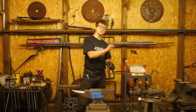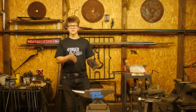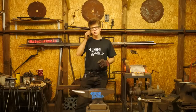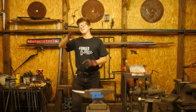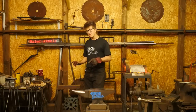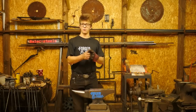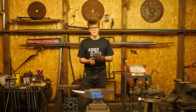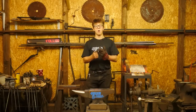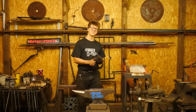We also don't want to just use straight carbon steels. In my experience, and I imagine the data would also follow with this, a plain carbon steel without any other alloying components tends not to have the same heat resistance as we go up that temperature scale. So for a drift working with a striker, I would recommend any mid-carbon alloy steel like 4140, which is EN19, 4340, EN24, or coil spring, which is 5160, EN47 here in the United Kingdom.